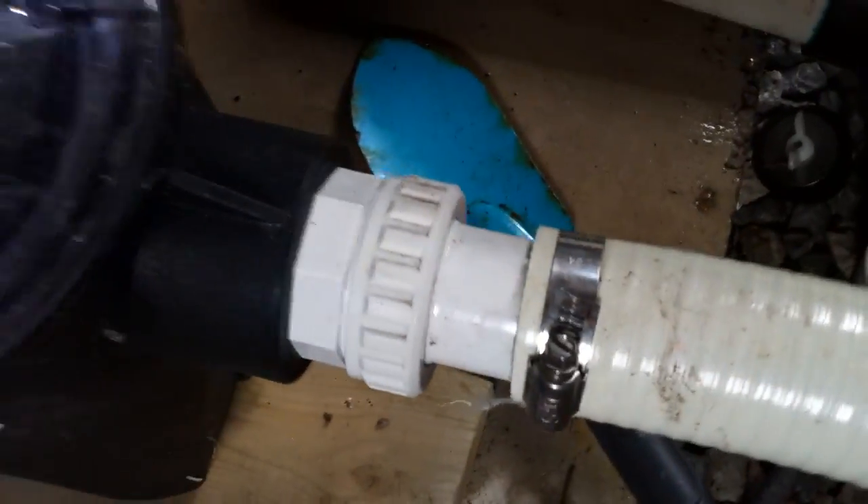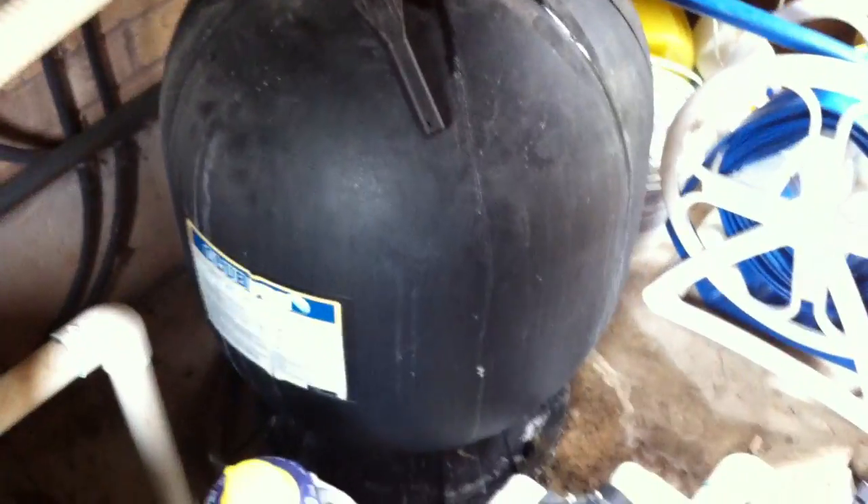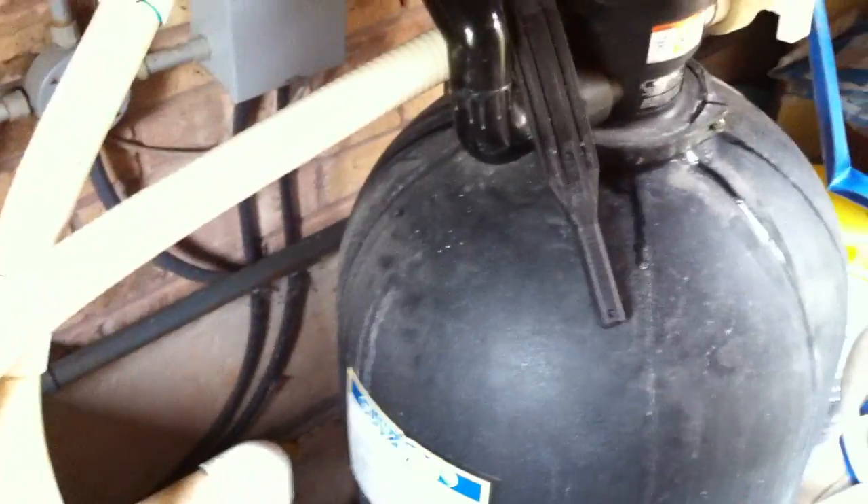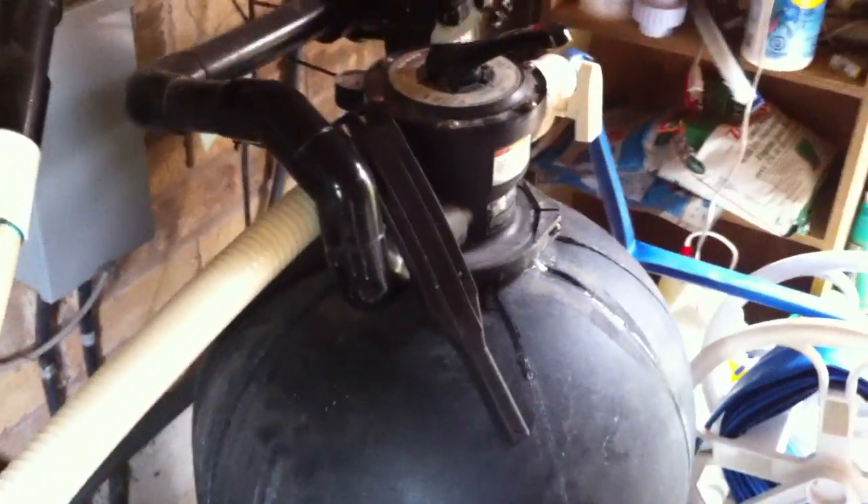Heater is not bonded. Pump is not bonded. Leaks — that is a serious issue that should be fixed immediately. But most importantly, most notable in this room by a long shot, is the fact that this filter is currently reading at 45 psi. 50 is the hard maximum that these systems can endure before they're dangerous and can explode. And 30 is really the maximum I would ever want to see my system operating at. You can see all the water that's leaking out of there. This filter could very well be at 45 psi due to a flow restriction — it could have been weeks or months since it was backwashed. I'm not really sure what would cause that, but I'm going to have to look into it because that's too dangerous to leave like that.